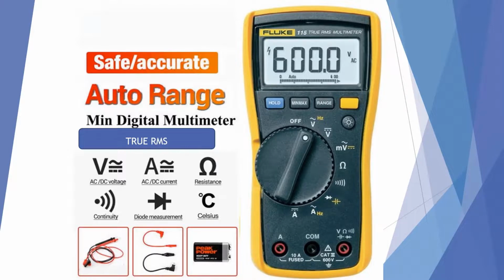As we said, there's a lot of different functions available on multimeters, and so you need to be careful to pick one wisely that will have the functions you need for your application. The one thing you also want to make sure you get is a true RMS multimeter. This comes into play when you're working on inverter type product and on ECM motor troubleshooting. A true RMS multimeter will give you accurate readings on the different types of waveforms that you will find on this product. So make sure if you're working on ECM motors or ductless product or inverter heat pump product that your meter states somewhere on it or in the instructions that it is a true RMS multimeter. It has been found that a meter that is not true RMS can be as far off as 40% in the readings that you take on ECM motors or inverter product.